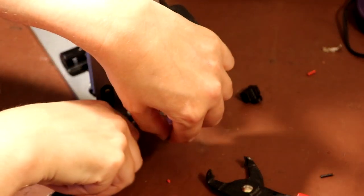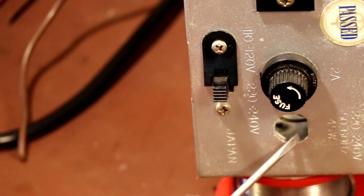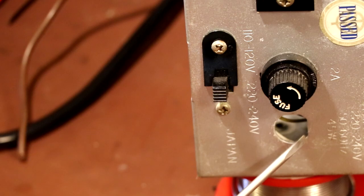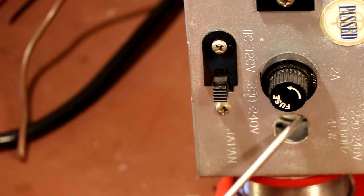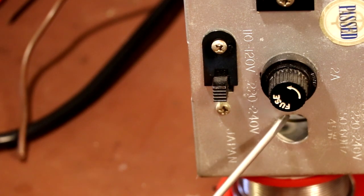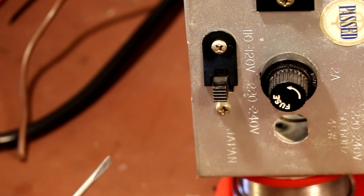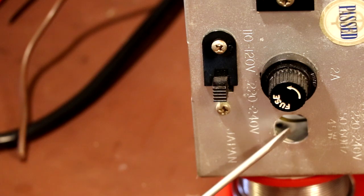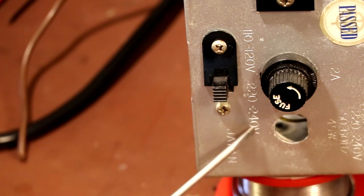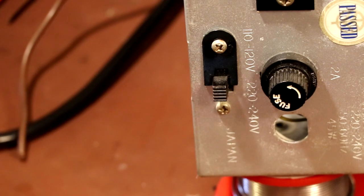Snippy, snippy, snip. Well, I have to say, the hole for our strain relief grommet is a bit of a funny shape. It's more than half round, about three quarters round, and then it's got a square section cut out of it. So it's an odd shape, and I'm going to have to figure out what we can stick in there. I think I might try and custom print some form of strain relief that we can put on the cable. Not sure, I'll have to give that some thought.